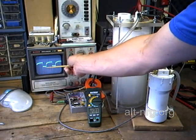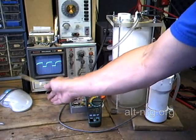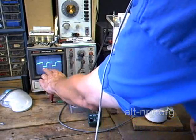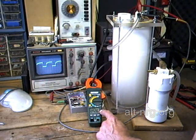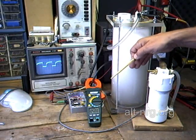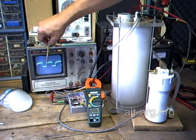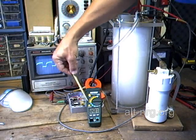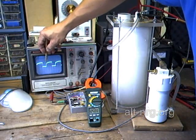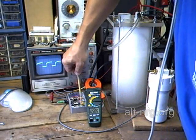I'm now at 2 volts per division. The settling voltage here is about 12 volts and the current peak is about 14 volts. Between pulses, the cell voltage settles here; if I were to disconnect power it would settle down to about 2 volts for quite a while. At this duty cycle it's drawing about 5 amps — that's where I've set my current limiter. As the cell warms up it will try to draw more current.